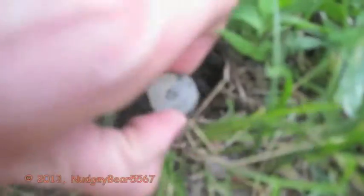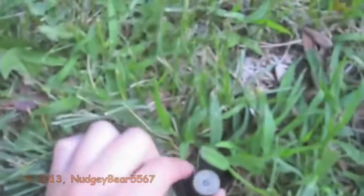Alright guys, so this is going to be the part of the video where I show you the old ones we have installed in our system already. One right there - boom, right off the bat. Didn't notice this one was an old Rainbird - it's a 180. It doesn't always pop down. This one has a very short pop-up, like maybe an inch or two. There's a ton of crap and dirt building up in there. What you do with these sprinklers is hold the head down and let it flush all that dirt out - that's how you get rid of it.